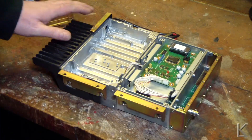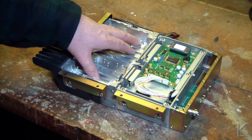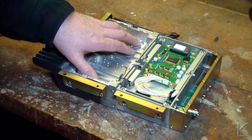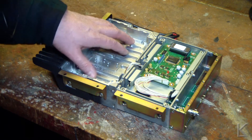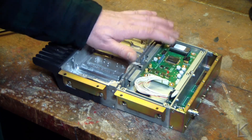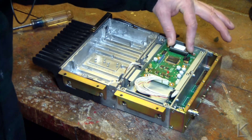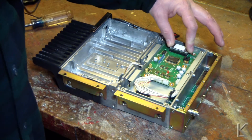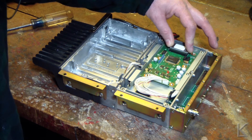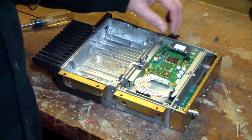Flipping it over, there's a big open space here — this is probably where the duplexer would go, either here or underneath this module in the chassis. I wish this one had a duplexer; that would have been interesting to look at. Here is the EEPROM — so the information I got off the internet was correct. This is the EEPROM you'd have to reprogram to push this into the amateur range and set the frequencies. It requires a bit of hexadecimal math and changing eight bytes.